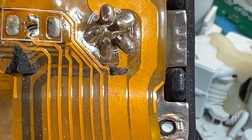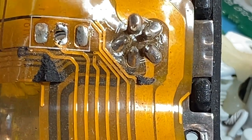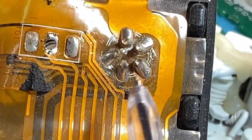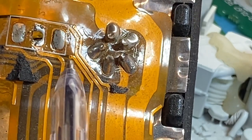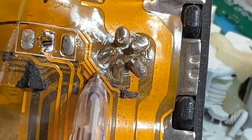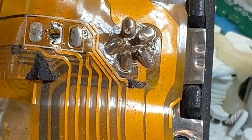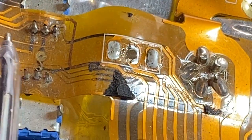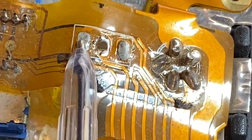And you have to be careful when you do it. You can't just push it on and solder this and then push it over there and solder that. If you solder this on without relieving the stresses in the mylar, it will break the copper. You've got to relieve the stresses out of this thing when you put it on. You've got fixtures here on your rotary encoders. You've got your switch.